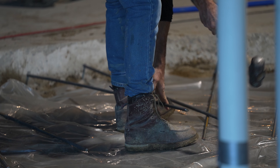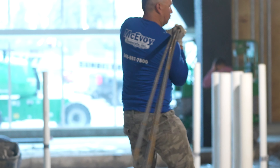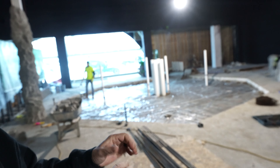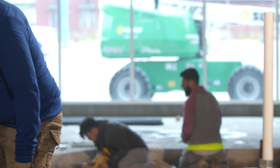They're making really quick work of this. The next step is actually pouring. Remember, this shark tank is gonna be about 200,000 pounds when it's filled up with water. So obviously they have to put down the brick to make sure the rebar doesn't go down further, then put the rebar that is actually attached to the existing floor so we don't have settling. And then once all of that steel is in, they pour the actual cement down and that's when you get the floor.